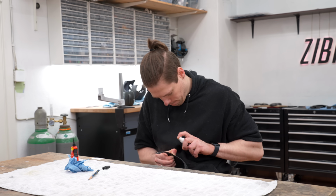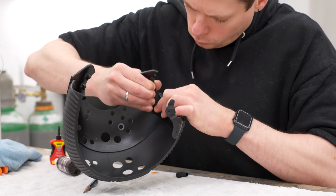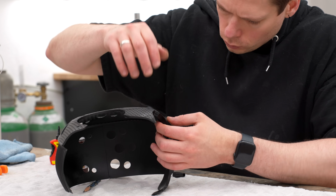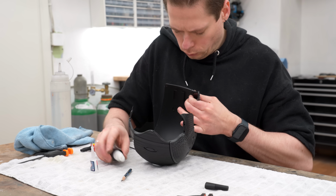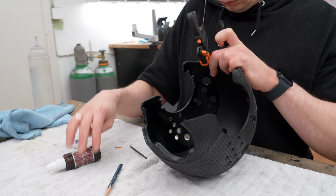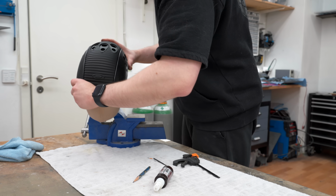Gluing stuff together was really quick as the parts were just so precisely fitted. It was actually fun to move this fast. To keep everything together, I used regular super glue, some CA accelerant, and some clamps. To make the joints more manageable, I didn't do everything at once. First I tacked down the front, and then I continued gluing the seam once I knew that the first part will not pop open. This way I just avoided having large surfaces covered in glue. You know, when stuff starts sliding around but freezes the moment you want to readjust. Yeah, so that.